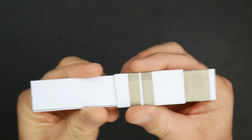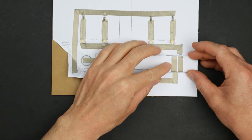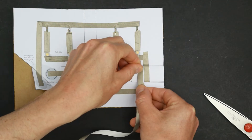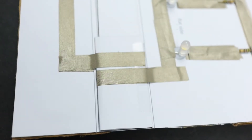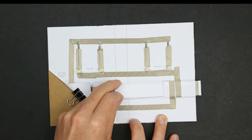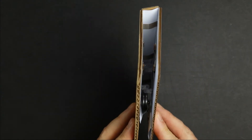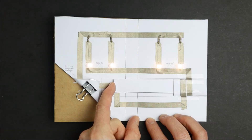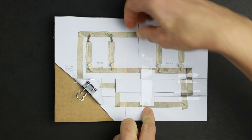Now test your slide mechanism. Attach the sleeve to the main circuit so that the strips of conductive tape align, then connect the strips on the sleeve to the main circuit. Double check your connections as it is easy to mess things up here. Test your slide switch, and if everything works, use some transparent tape to better attach the sleeve to the main circuit. Now adjust the slide switch so it turns the LEDs on and off — for a start, push the slide switch through until the LEDs switch off, then add a strip of paper as a guide.